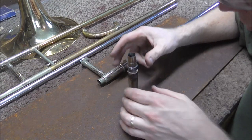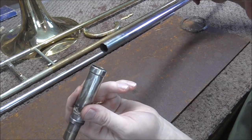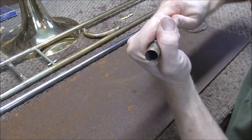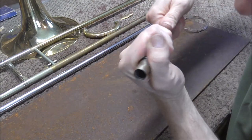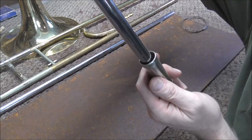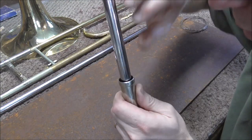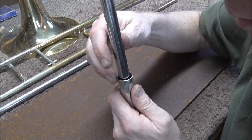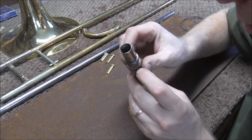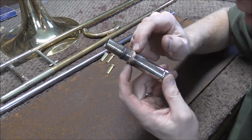It's been a few minutes — let's see if I can touch this. It's still a little too hot. The part has cooled off enough so that I can touch it. Now I'm going to put this slide into there and see how it lines up. It is a little bit off, but it's not too bad. So I'm going to bend that — okay, it did bend without any problem. Now it should be good, so I'm going to finish soldering. I'm going to go to the opposite side and solder it there first so that it does not melt the tack side. I want this side to stay where it is.